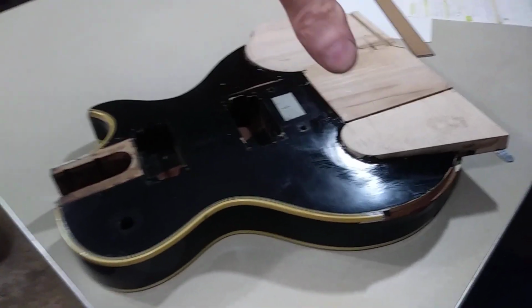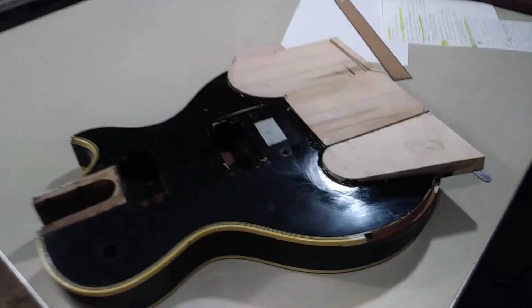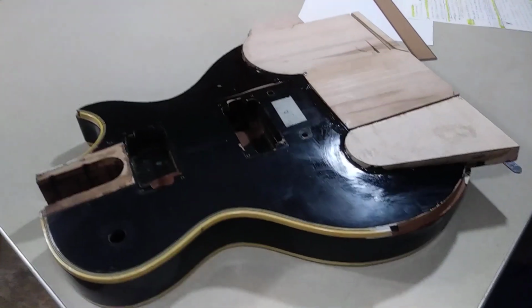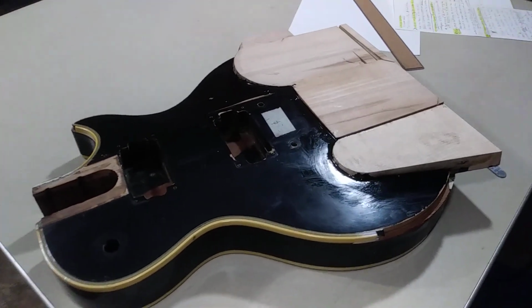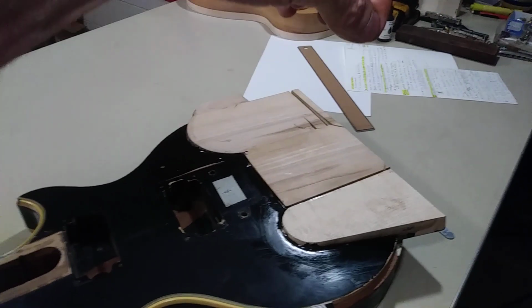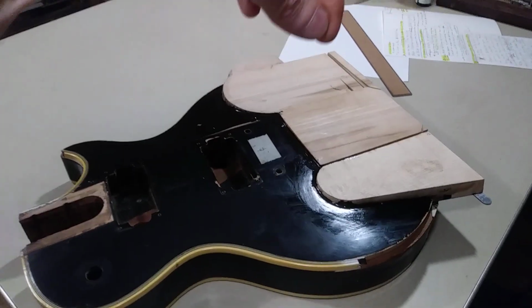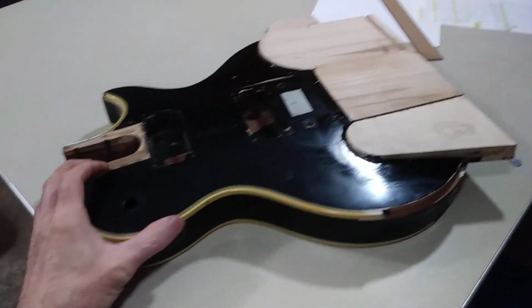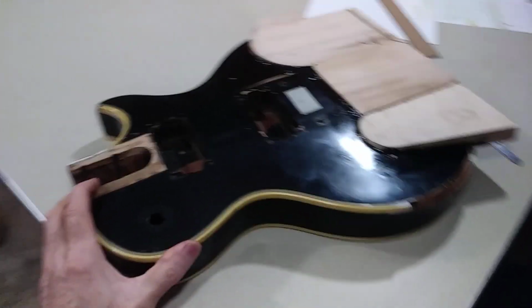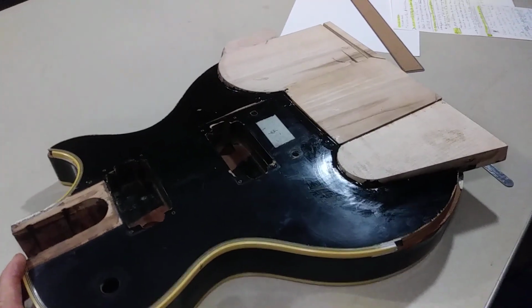So mix your epoxy, let it kick, wait for 1 or 2 minutes, and then maybe mix it again. Then add, and I'm serious when I say this, just a toothpick tip of the black resin. It's amazing how little you need. Then mix the black resin in, or the red, or the yellow, or your tints. I've never tried a trans tint with an amber, and I don't really see the need in doing that.